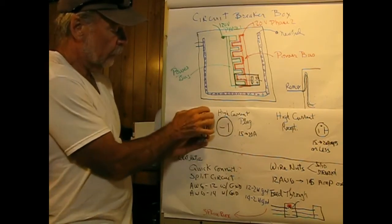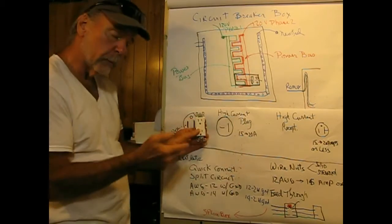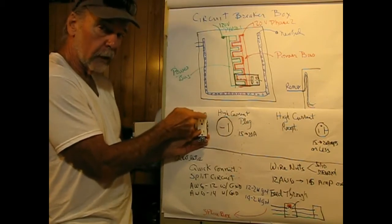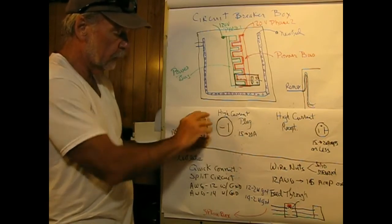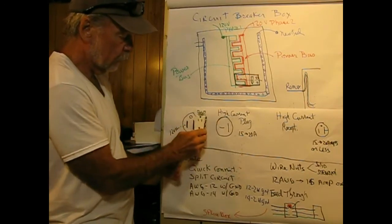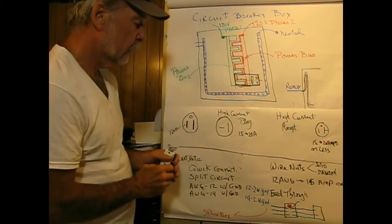What had happened is she dropped the wall plate and it came down and was able to fit between the plug and the receptacle, hit the two plugs and burnt nice little arcs in the wall plate. Didn't do any damage, but if that were upside down and the same thing were to happen, the metal plate would hit the ground. So that's the correct way to install them, with the ground hole on top.